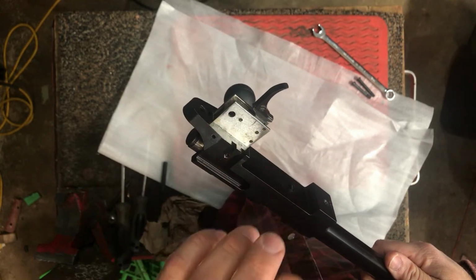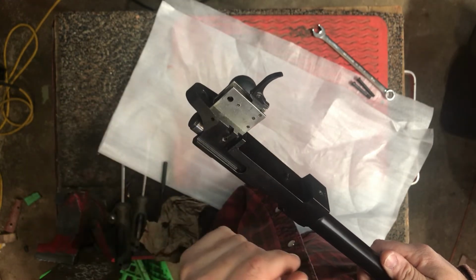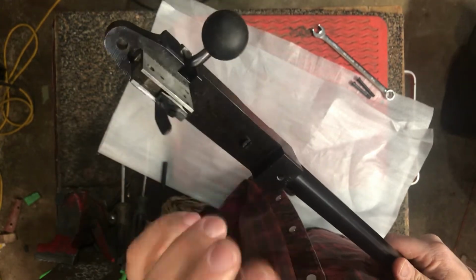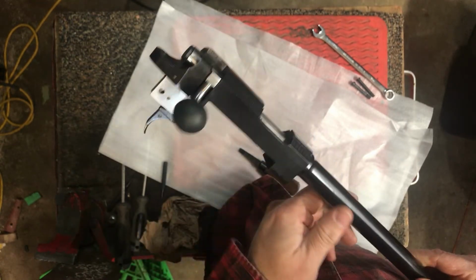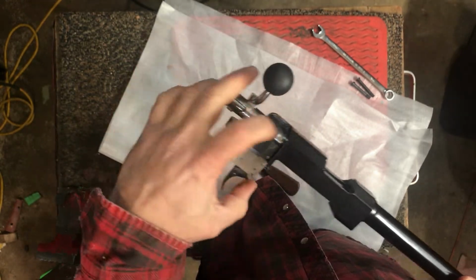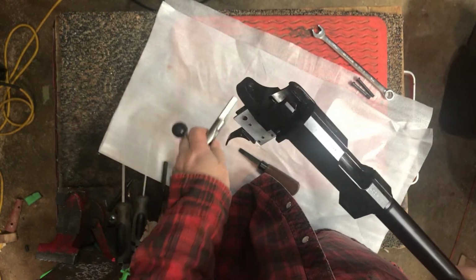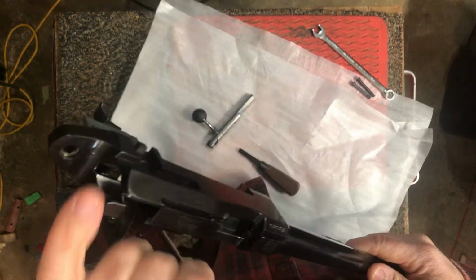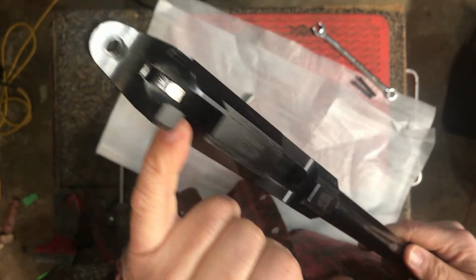However, all the surfaces are hardened steel. The bearing surfaces of each one are very, very highly finished. It's a beautifully made trigger, but a little bit on the intricate side to get back together. So you open the bolt, it slides back, depress the trigger, bolt comes out, just like any direct sear gun. You can see the shot of the sear down there, contact surface, and again, the massive receiver.